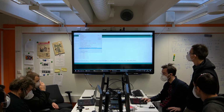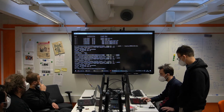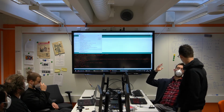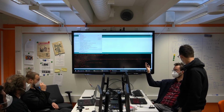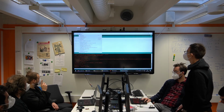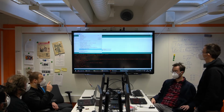Doesn't matter. So now both of the boards are connected. Which of the boards is Arduino detecting? None of them. Sorry, I just programmed it so it appears again. But let's erase it, and look at that. No boards. That's because the SWD programmer is just not visible. The other one doesn't have code on it yet, so there are no serial ports right now. But if I burn the bootloader, you can use the Arduino to burn the bootloader on any board that is connected and that is not a programmer. Okay, that was my question. It's a very good question.